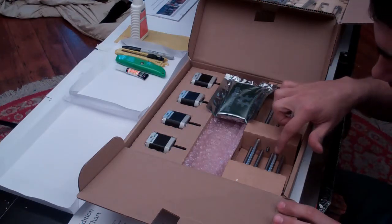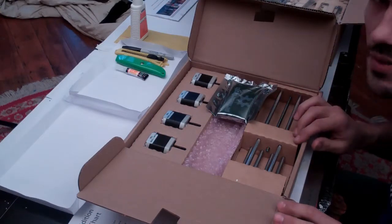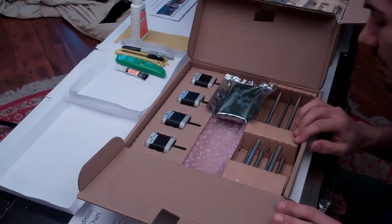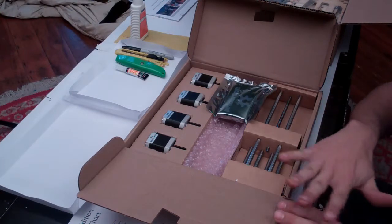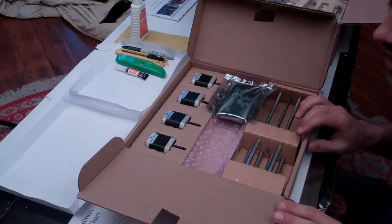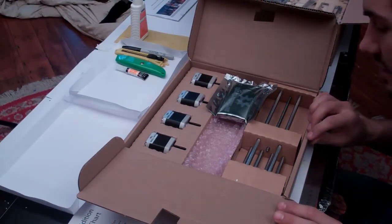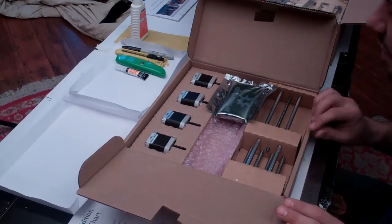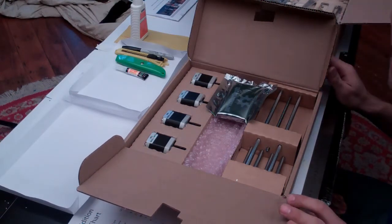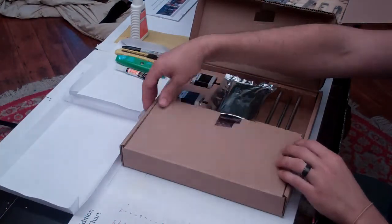And lastly, there's 6 extremely shiny metal rods. These are bearing rods. They're incredibly smooth and incredibly accurately milled. They actually grind them perfectly cylindrical, so very, very delicate rods. The only thing that should ever touch these will be the bearings that use them. So for now, we're going to leave all of these pieces in the box where they're safe and nothing's going to hurt them.